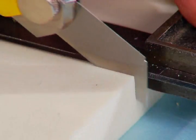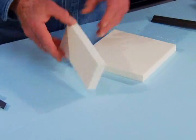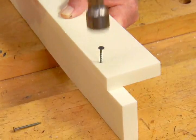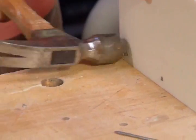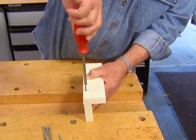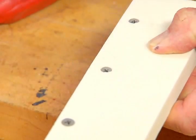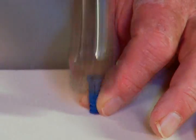It can even be cut with a utility knife. Parts made from INAKOR can be assembled using ring shank nails, finish nails, and hand or power driven screws. For extra gripping power, threaded inserts and plastic anchors can be used.